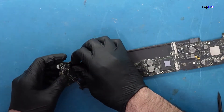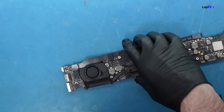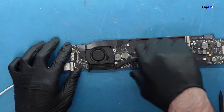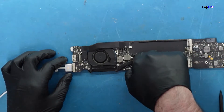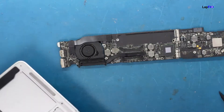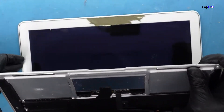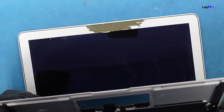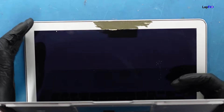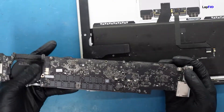Let's plug in just the power cable and the display cable — don't forget this cable, it's also going to get your light to turn on. The processor gets warm, the fan does spin, and we're getting an orange light. Let's try plugging in the screen without the keyboard or speakers and see if anything else changes. If it's a RAM issue, it's not going to get any type of display.